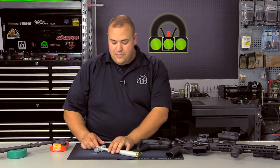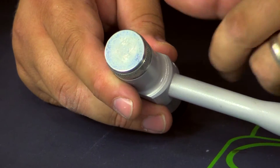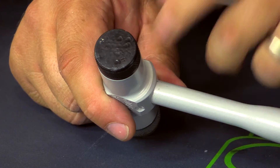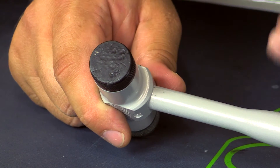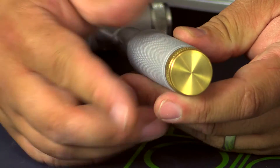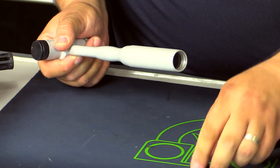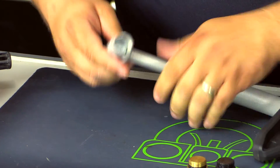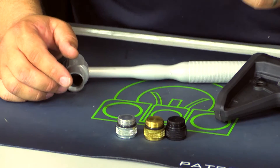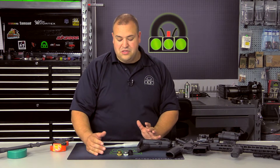They were thinking ahead — the actual heads of the hammer, the strike surface, are one inch in diameter and they're all over steel. You actually get three of them with the hammer. We have steel, which you could use on your heavier punches; a non-marring Delrin head, which has seen some use in the shop — it works great if you have to nudge things or don't want to mar a surface; and a brass end as well. You just loosen one and you can see that O-ring seal. They are held nice and tight — they're not going to loosen up as you're using them. I've used this hammer a lot and the steel and Delrin heads have not backed out or loosened up during use.